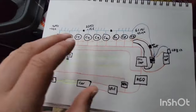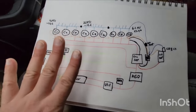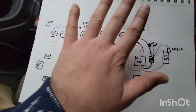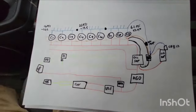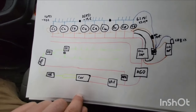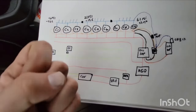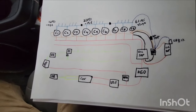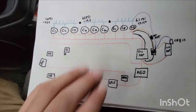And let's say worst comes to worst, and you replace condenser fan motors. But if you're going to lose the whole store, you might have to put it on a sprinkler for a day. Sprinklers will destroy your condensers, okay? The minerals in the water, the chlorine, the fluorine, all that garbage will get into that condenser and destroy it. A year or two of sprinklers and those condensers will be absolutely ripped, dead. They're going to be calcified and put together. So last resort, if you're going to lose everything, $100,000 versus maybe a week to get the fan that you need, you have to evaluate that as a tech.